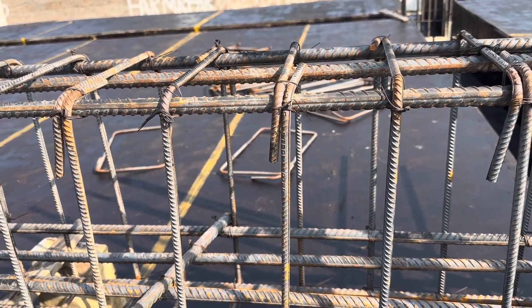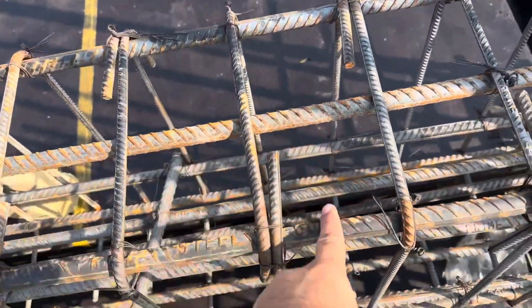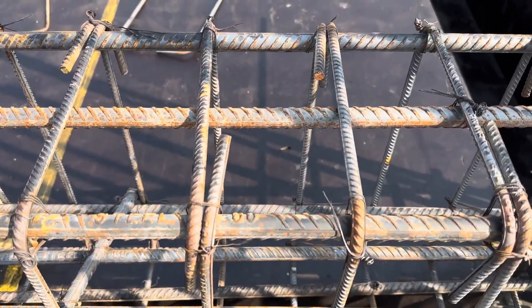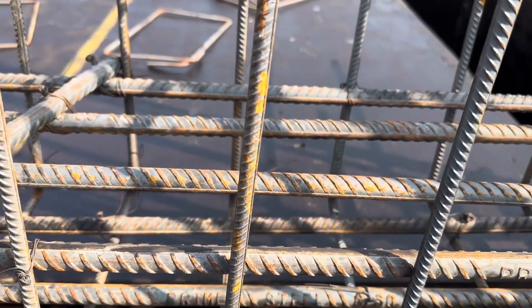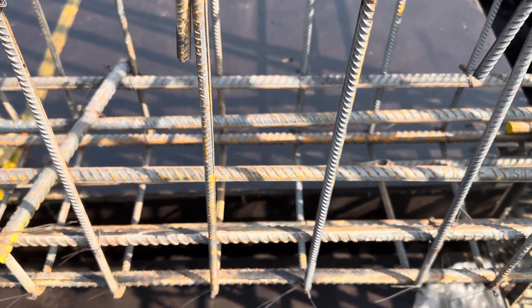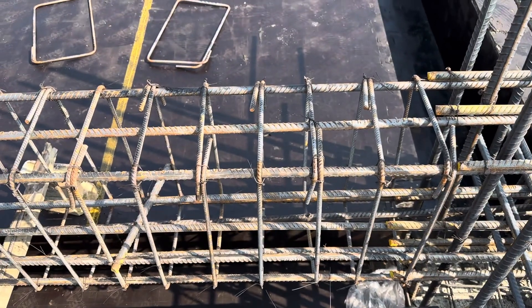So in this section we have a total of 11 numbers of steel rods. Three bars at the compression zone which is the upper portion, four bars at the bottom portion, and four bars at the middle. The diameter is 20 millimeter, designed for a seven story commercial building.